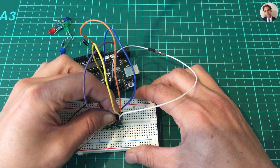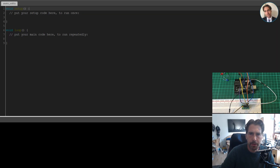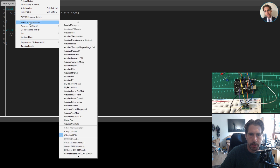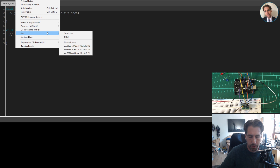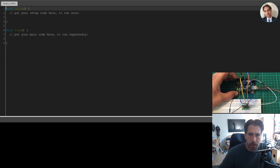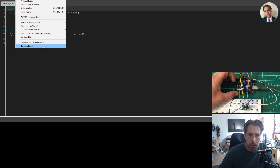The clock pin goes to the middle left on this board. Now the first thing I need to do is open up the Arduino IDE and select the right board, which in this case is an ATtiny44, and I'm gonna use the clock internal 8 MHz. Then I have to connect the Arduino, open Tools again — it's COM4 in my case — and then burn bootloader. There we go, that's done, and it doesn't take very long.